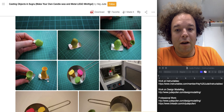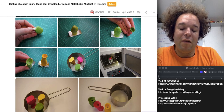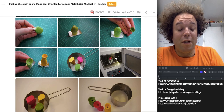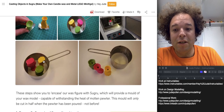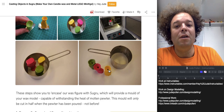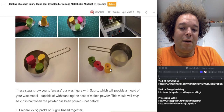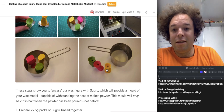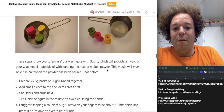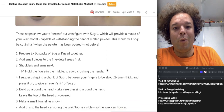Leave that to dry overnight — 24 hours if you can — then pop it upside down into a little dish and into a small oven. A home oven works fine. All that happens is the wax melts and comes out, leaving a crisp internal mold cavity for the metal to flow into. If the mold were bigger you might need a riser to allow metal to escape from another side, but this is such a tiny mold you really don't need it — the gas will naturally escape. It's a good thing to look up if you're getting little pockets in the mold.